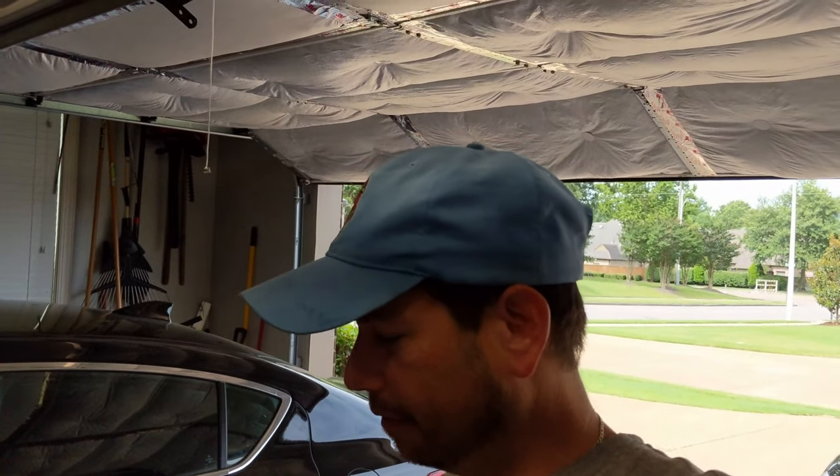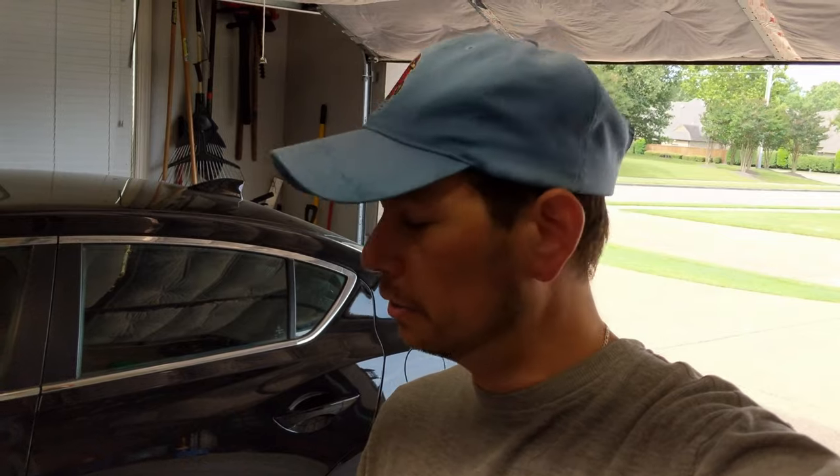Just to let you know, I've already calibrated my sprayer. What I did was I filled it up to almost full with just water, and then I walked at a reasonable walking pace. When I had it on setting three, I really had to move. I was really booking, so that was not ideal, and then I was walking into the drift. But with setting one, it's nice and controlled. I can take an easy stride, and the timing came out perfect. So that's something I recommend that you do, to figure out how the product goes down for you, so you don't over or under apply.